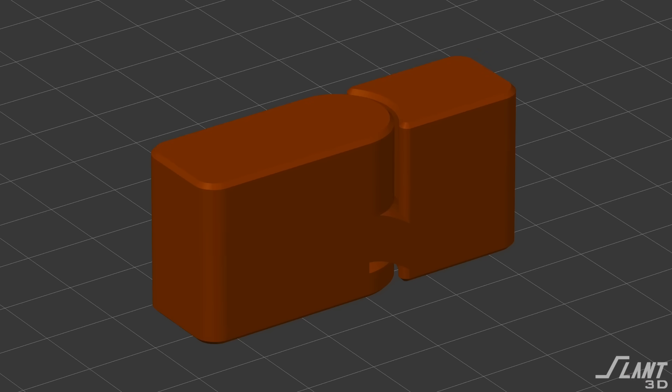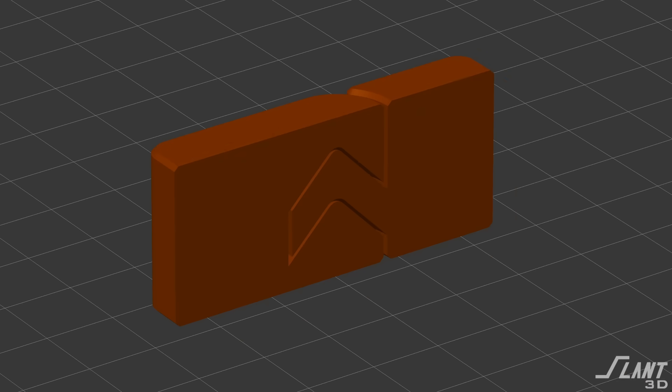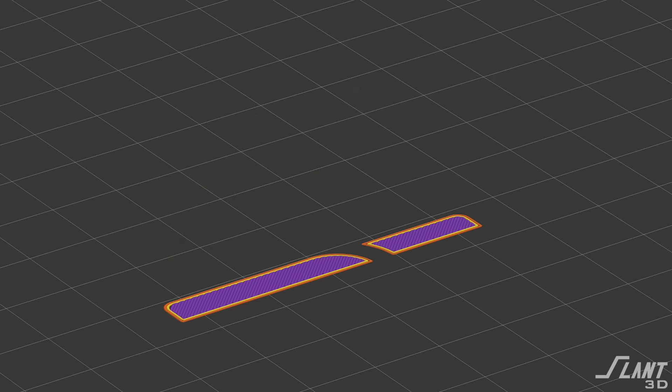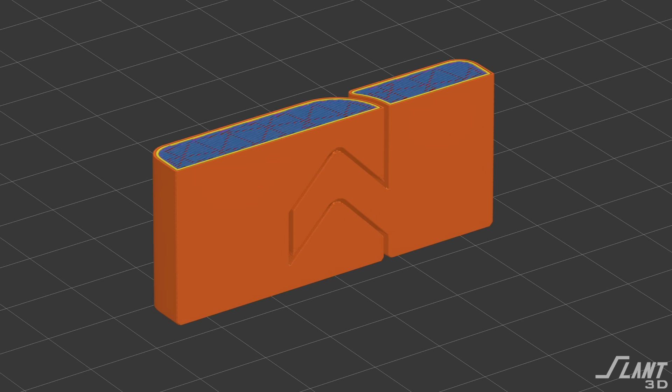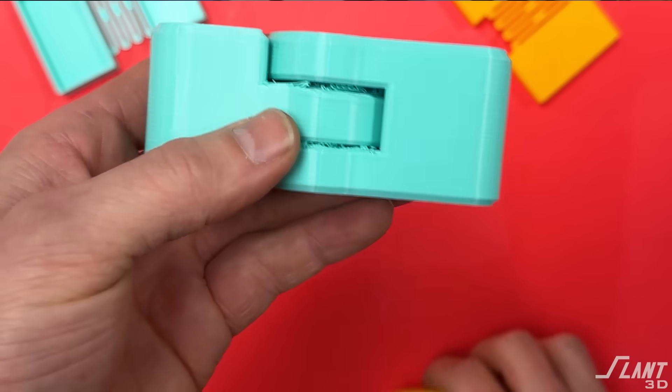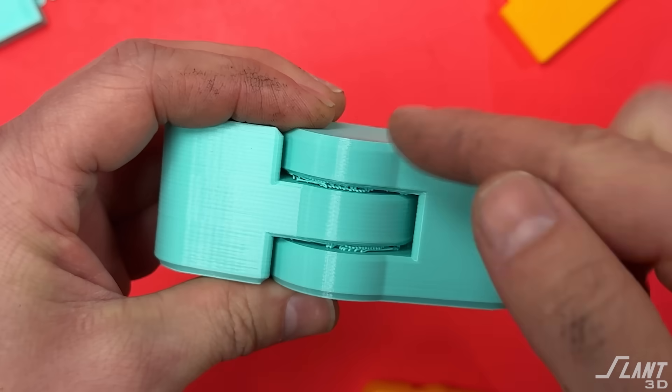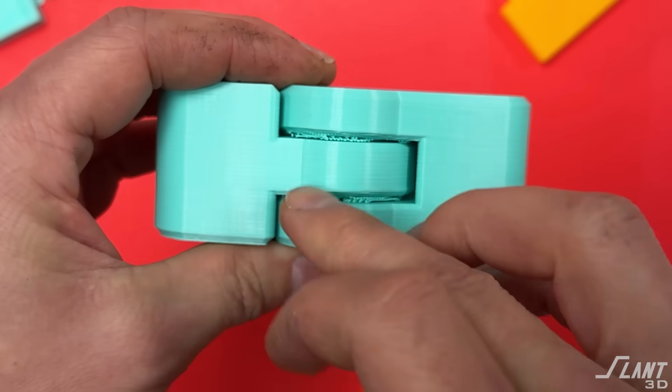You connect to those two top cones so it's a lot easier. The other thing you can do to refine this even more is to put one cone on the bottom and then one cone on the top of the other link. This way you have nothing falling down onto the print at all — it's all just perfect vertical geometry that is a lot more reliable to print with. The one other option is to again change orientation.